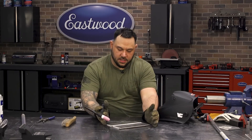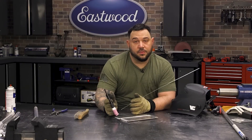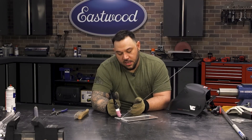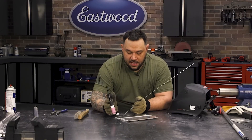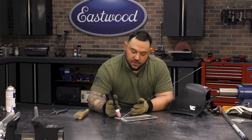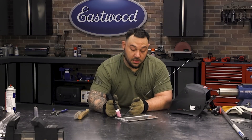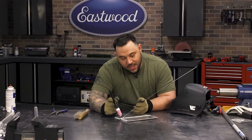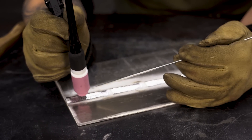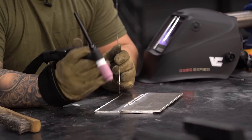We've got this plate welded up all the way across. The alternating current is a little loud. One thing that's pretty important when welding aluminum is where you're positioning your filler rod. Once you create your arc and your puddle, the last thing you want is to leave your filler rod inside the heat area — your filler rod is going to ball up and stay impure, and by the time you drop it in there you'll get a really messy, crud-filled weld. It's important when dabbing with your filler wire on aluminum that you're retrieving the wire all the way out and then reintroducing it into the puddle each time. We're not really shoving it in — just riding the edge of the puddle and feeding it in until the bead profile builds up. Aluminum is a thin, brittle material and will ball back very easily with heat, making it very difficult to create a nice bead profile if your filler wire is all balled up.